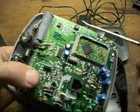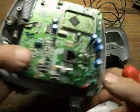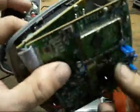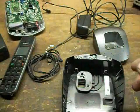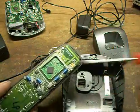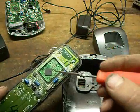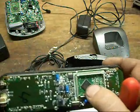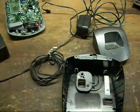I'd say this here is probably a static RAM or a flash ROM of some type for storing the messages and stuff on the answering machine. But there ain't much else in this unit besides the display and buttons, which is just an LED display. It's pretty thin for pickings on experimenting except for the core unit, which is the prepackaged ARM chip. The only way to make use of that is being able to find the in-circuit programming port, and if the chip hasn't been permanently firmware locked — best luck with that. I might dig into it one of these days, but not now. Take care, take it easy.